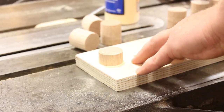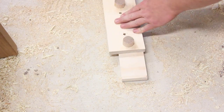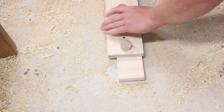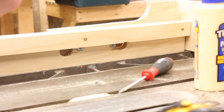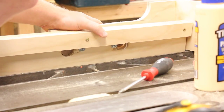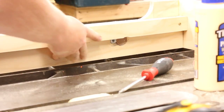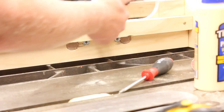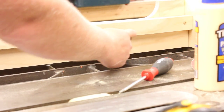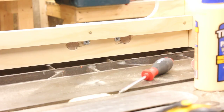Clutch! I cut these rails the full length because I didn't really know where to cut them off with respect to where I wanted to put the dowels. So now that the dowels are in place I'll cut the rails off about a half inch past the dowel, and that should give me plenty of strength. Because this is all plywood I'm not worried about splitting unless it's end grain.